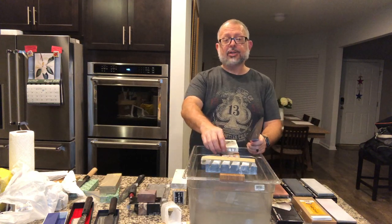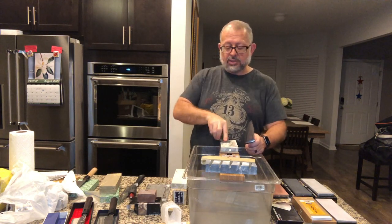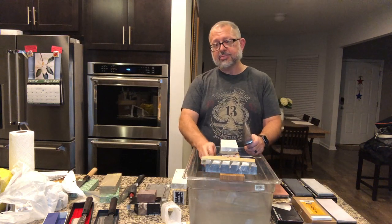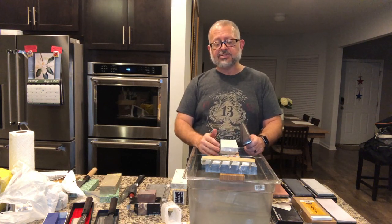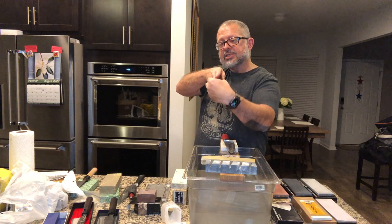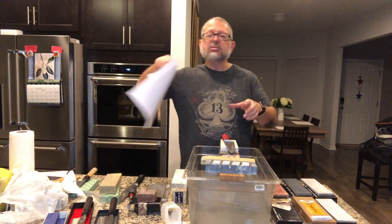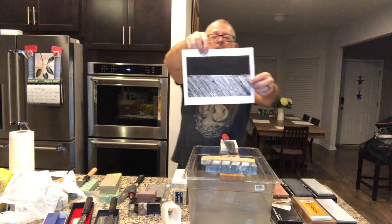Now, earlier when we were on the 1000, so let's say we're on the 220, the 400, and the 1000, and we're sharpening, then burrs matter. So once we put on the 3000, we're like starting to polish / deburr. So if I went back and forth and did no forward strokes like I did on 1000, I would still feel the burr wiggling. And so we would still be trying to line up the end. We would still drag it across to try to get the wire off. But then at some point, the knife's edge is like out of line. And so we're gonna put it on leather to really make the little edgy teeth. There's the little edges. They come crazy clean.